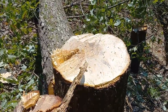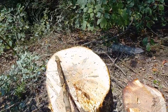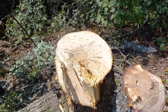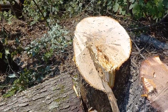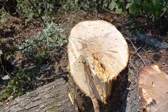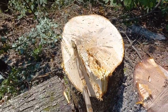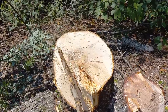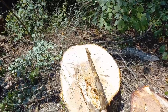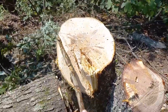Then you come around and you plunge, mindful that the tip is going to want to get pinched in here. You don't let that tip get in that zone — you come back here and start cutting for this notch, because my notch was in here to send the tree right there, and it went exactly where it was told to. You plunge in there and back out, plunge and back out, give it a few seconds because the kerf is going to close. The next time you plunge you'll recut the kerf and keep cutting a trench that your bar can stay in. This side has closed up so it can't close any further, but you can keep machining wood out of that spot.